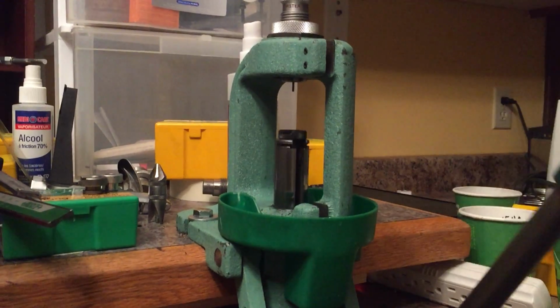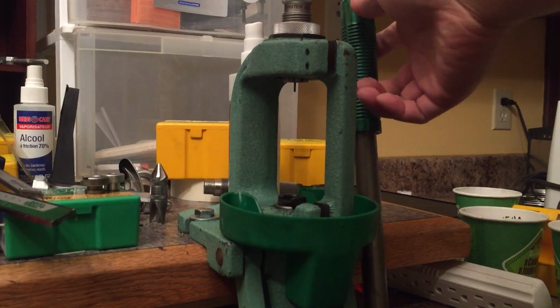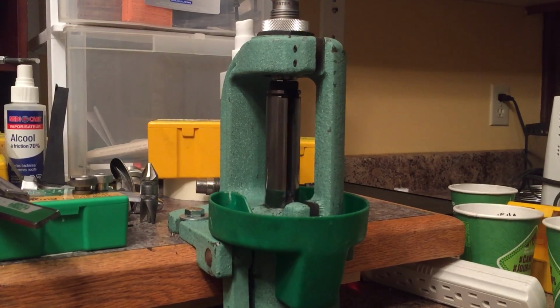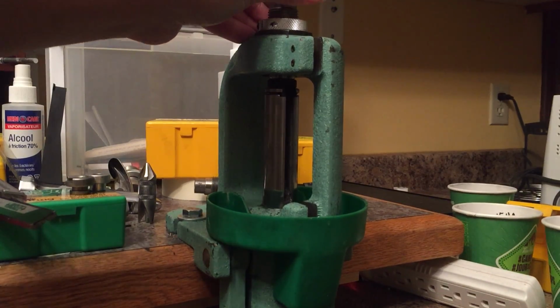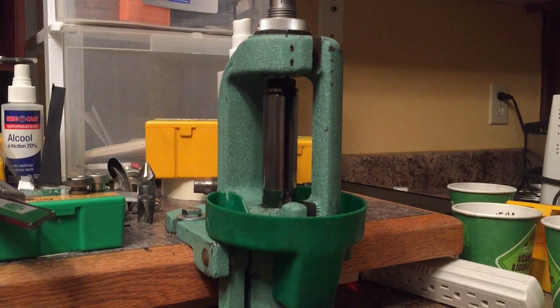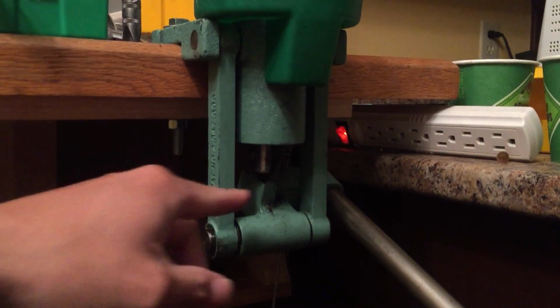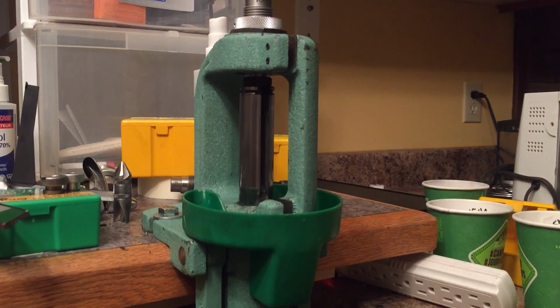I assume there's a little bit of slop in the machine and the parts, so that's why you might need some cam over. Also, I checked online and they said the reason is that once you close it, there's a little gap, a mini gap when there's brass, and it won't go all the way up. Once you seat it, you assume it's going to touch, like it's zero fit, but it's not. There's still a gap. I think it's because of the slop, the loose tolerance at the bottom, like there's give here and probably give there, but whatever the theory is, it doesn't matter. It's just what happens.